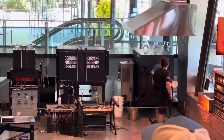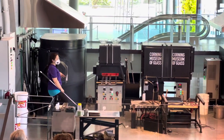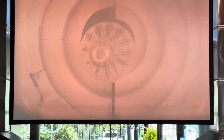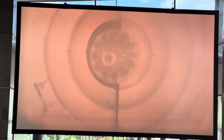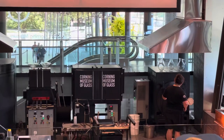Foot work works through temperature control. Our central form — the main body of the piece, the big optic bubble — is allowed to cool down so it's rigid enough and won't move around. We add that next bit of glass that becomes the stem, shape it out, and every tool draws heat out of it as it cools. Once it's cool and rigid enough, we can add another gather of glass to the bottom of the piece to create the foot.